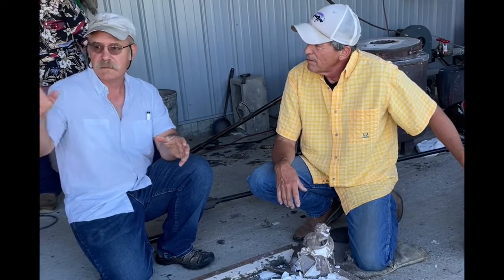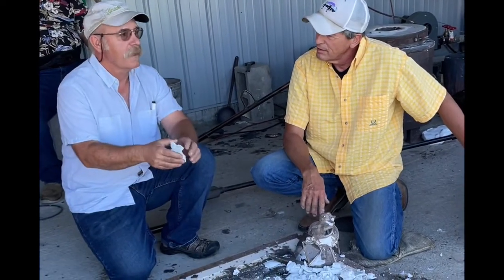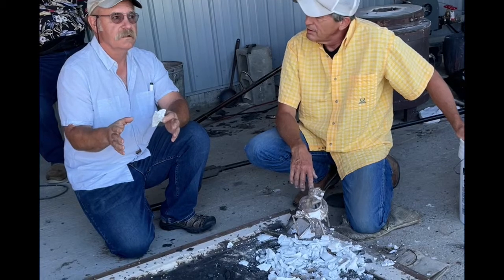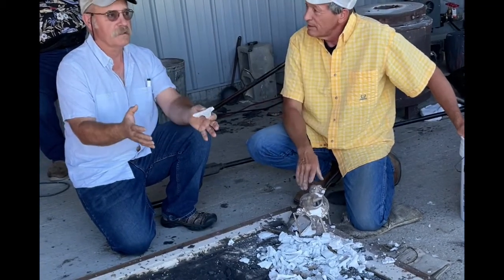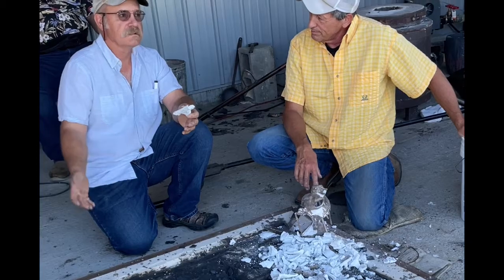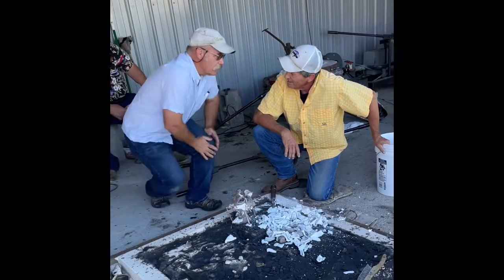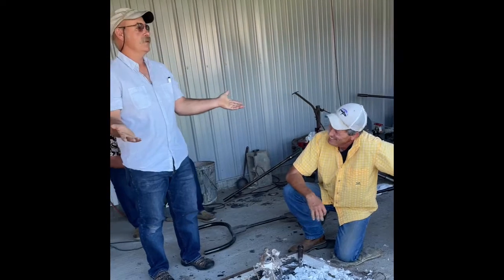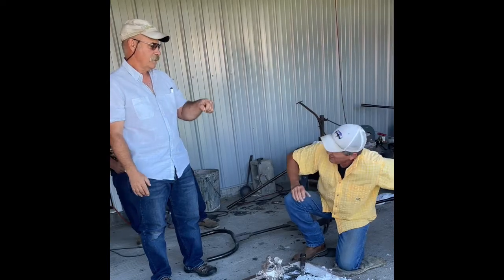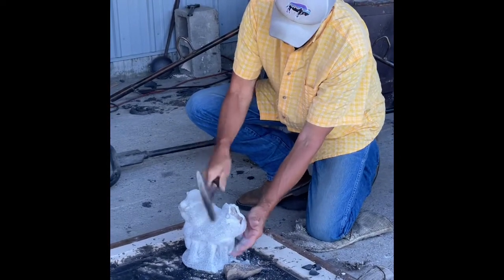What I do is take colloidal silica — it's what you make ceramic shell out of. I call it liquid sand; it's got a binder and sand in it, very thin, looks like milk. I mix that with plaster-paris — a 50-50 dry mix of plaster-paris and sand. You can buy it pre-made from Ransom & Randolph, product 903 — it's kind of green-looking and has fiber in it. It's a great way to do tight places you're not going to get into that might mar your bronze.